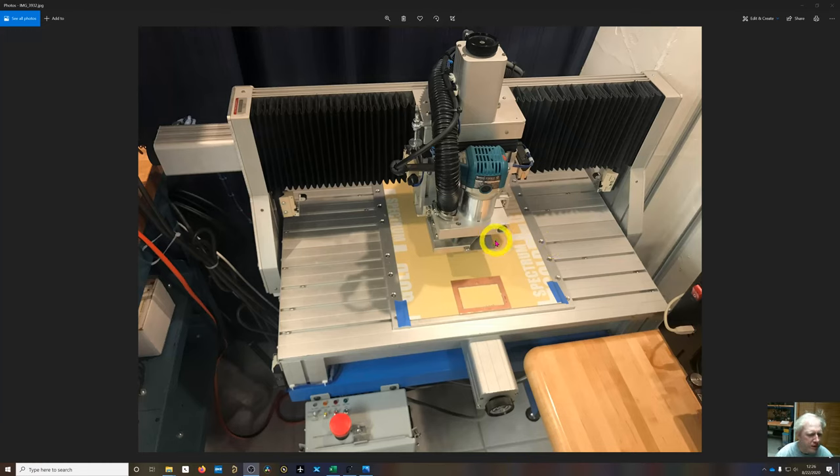In the last video I showed how to do the inverted F antenna in Microwave Office and I generated the Gerber files. In this video I want to go over my CNC router and how to use the FlatCAM software to generate G-code to run the router. This is largely for my own purposes, because I don't do it a lot and want to remember the settings between iterations.